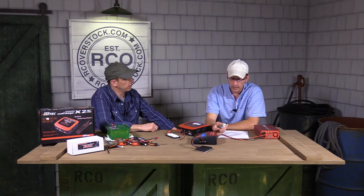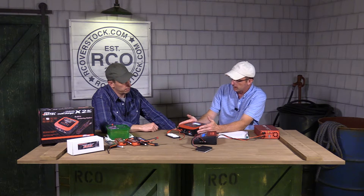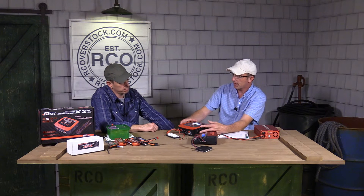My charger can check IR — what do the numbers mean? What's a good number, and is it accurate? What do the numbers mean if you have nothing to base them on? Any number can be a good number if it's always the same every time. As for accuracy, it's going to be as accurate as these chargers allow. The tolerance of the ICs and such — these are not thousands of dollars worth of sensitive, calibrated equipment. For basic ohmic resistance testing it does a pretty decent job, acceptable for our purposes.